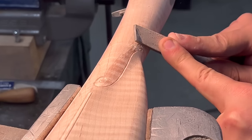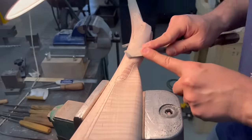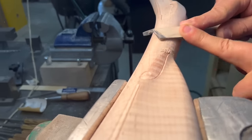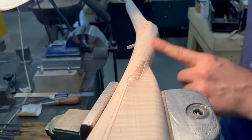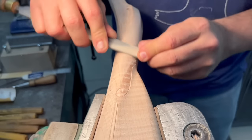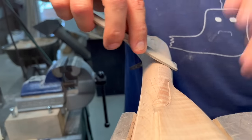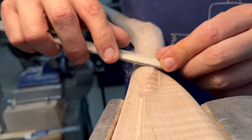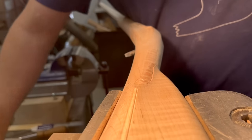I'd also often use a skew chisel for this type of work — you can get into the areas real easily. The skew chisel lets you get into these little tighter areas better, and you can also trim the sides if you want to adjust the shape. This is a bigger open area — we're going to blend it, make sure it's a smooth transition from the background. We want to make it look like the wrist is smooth with no abruptness from the wrist down through that relief area.